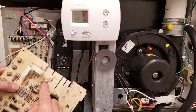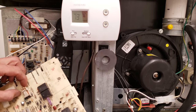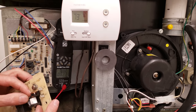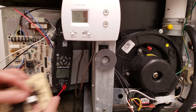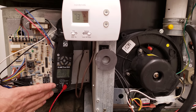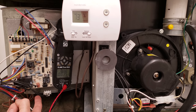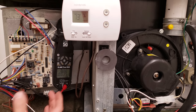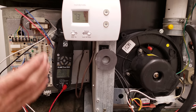This little contact in the relay box — that's all it is — a tiny thing. Here's another example with a larger relay: you have your coil and your contacts. You can have burnt contacts not allowing power to go through. If you have a bad relay, just go ahead and replace the board. If you have a loose solder joint, you can turn the power off and re-solder where the pin is to get the building owner some heat, but it's a lot faster to find and replace a board than to find a relay of the same size and current rating.